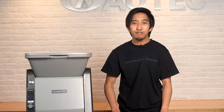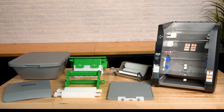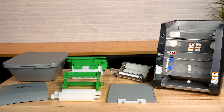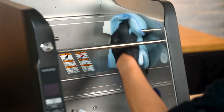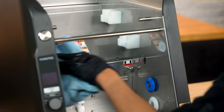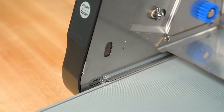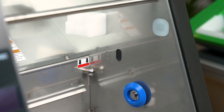Taking care of the 895A is really easy to do. All the removable parts — slide base, cutter base, forming rollers, rice guide, hopper base, front cover, and hopper — must all be washed in the sink with light detergent or dish soap, a soft sponge, and some warm water. The main unit is cleaned using a damp cloth. Wipe everything down, including the back panel and all of the shafts. Give extra attention to the red oval-shaped sensors and white square-shaped sensors throughout the machine.